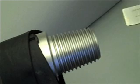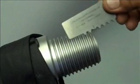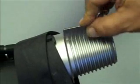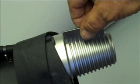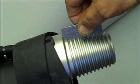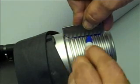Now, using the proper length profile template, every profile template has the threads per inch, taper foot, and the thread form. I set it down into the thread, and I run it around until it basically touches the shoulder. I back up, I hold the profile firmly into the thread, and I start wiggling it back and forth as I'm pushing around until it makes contact with the shoulder. And I scribe the thread, and then I mark the thread back down the taper.